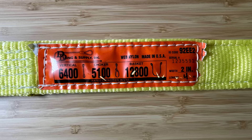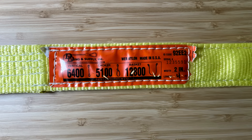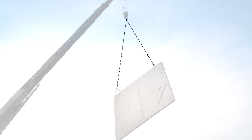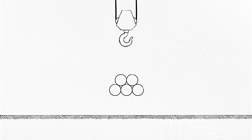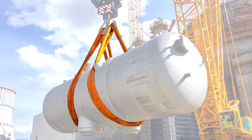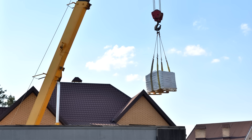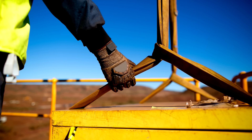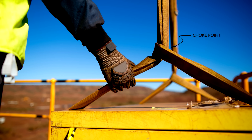So what do these tags mean? It's actually pretty straightforward. The tag shows how much weight you can put on the sling using three basic hitches. If your load has a hook or shackle, you can use the vertical hitch — one eye over the load and one eye over the hook of the crane or hoist. It's the most straightforward configuration and takes full advantage of the sling's load capacity. If there is no attachment point on your load, you might instead use the basket hitch, where the load is cradled by the sling and both eyes are on the hook. One benefit of the basket hitch is that it doubles the sling's load capacity since you have two legs holding instead of just one, but it only works if the load is balanced and easy to control. If you need a snug grasp on the load, you might use the choker hitch, where the sling passes through one eye and attaches to the crane hook on the other. The choke point has extra stress in this configuration, so the load rating for a choker hitch is less than that of a vertical or basket hitch.